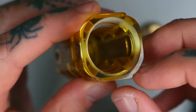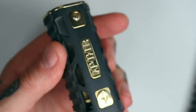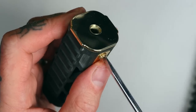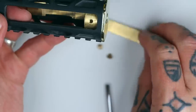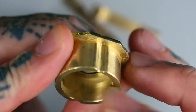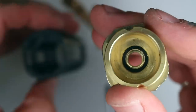There's the inside of your tube — beautiful Ultem machining. Let's break it down. We'll unscrew the top screws here, which hold our firing bars but also hold our 510 plates. Just unwind both of these. Out come our fire plates, and then we can push our 510 plate out of the block. There's a little bit of Ultem in there. I gave this thing a bit of a rub with the Brasso before, so let's clean those two up and get rid of the excess polish.